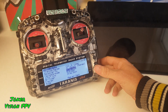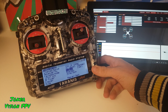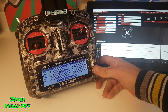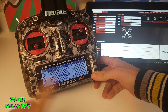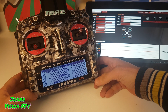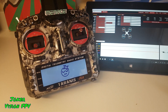If you do come across this and you need a fix, it's simple. Go to no pulses, then custom, set to the bottom — it says outputs failsafe hold — and it will put all these in. Then change the top one to minus 100. Now when you power down, motors — nothing.